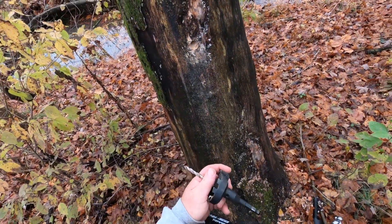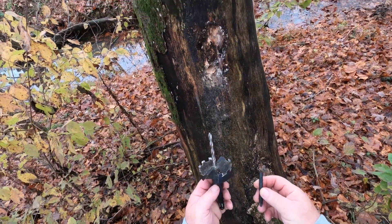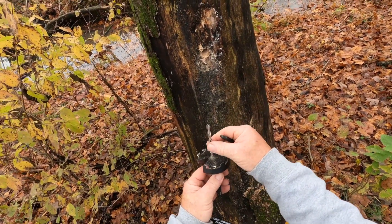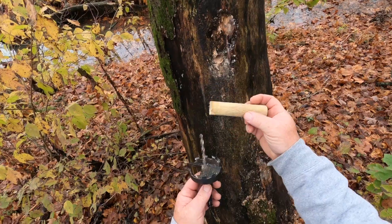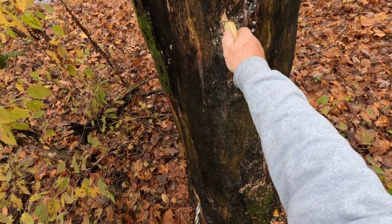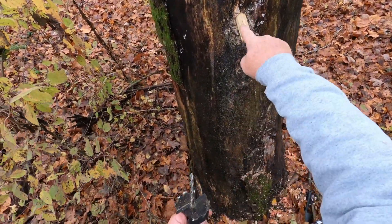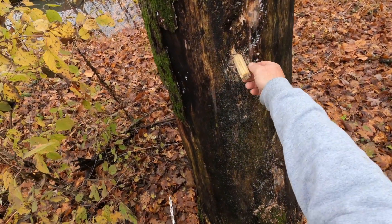This is the 3-inch bit here. When I bought this from treehousebrackets.com, it came with a bit just like this. What I did is I replaced it with the same size drill bit because I needed something a little bit longer. And I made this little gauge to help me keep it straight — it goes into the hole like this. Because this tree is irregular and not perfectly flat, and this cutter is so big, it needs a guide to keep it perfectly straight along the axis of the inch and an eighth hole.